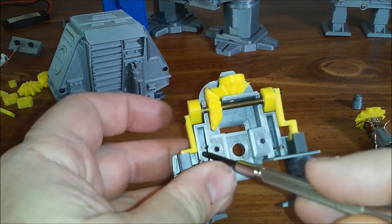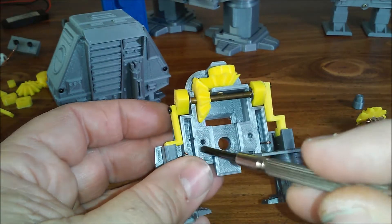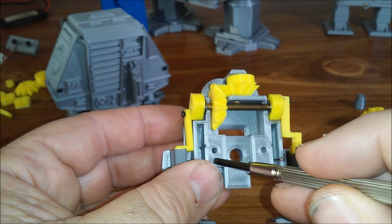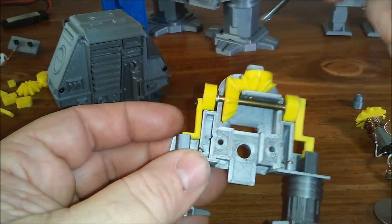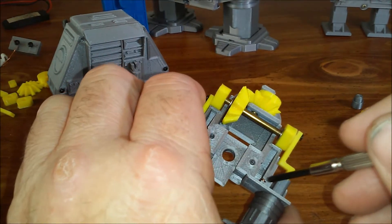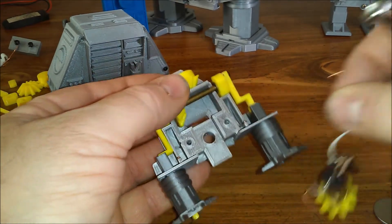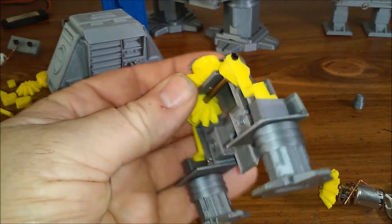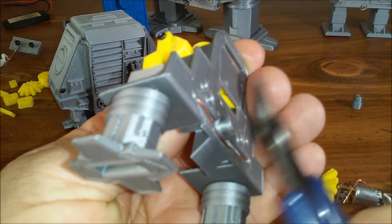The battery compartments for the CR2032 batteries have holes on the inside and outside with little troughs for the wire. The wire is solid 22 gauge hookup wire like you'd use on a breadboard. The outside wire hooks in at the top, goes through the bottom, all the way across, and back up to the top, then is bent over on the edges to hold it in. The two inside wires sit in little troughs and come out through holes in the bottom. After building it, use flush trimmers to trim off the wire as it comes out.